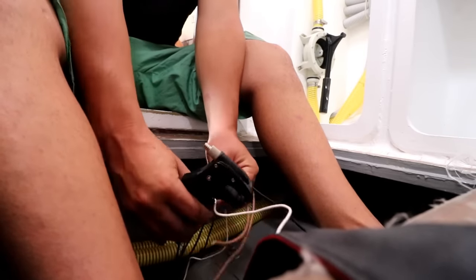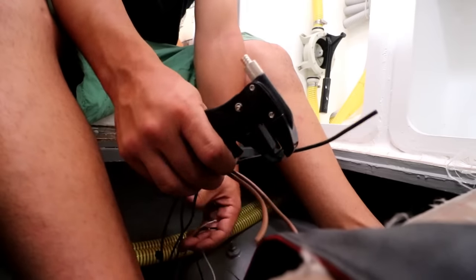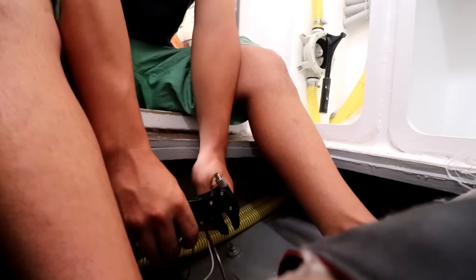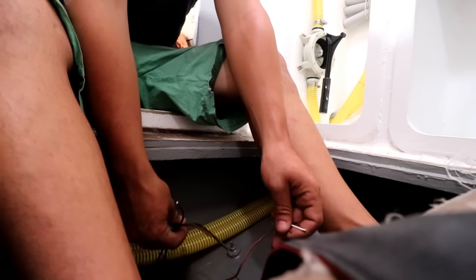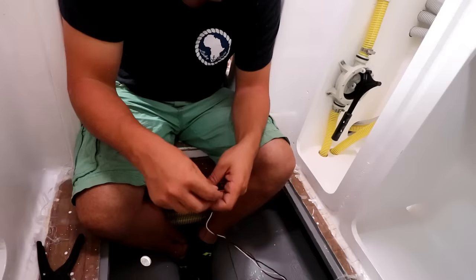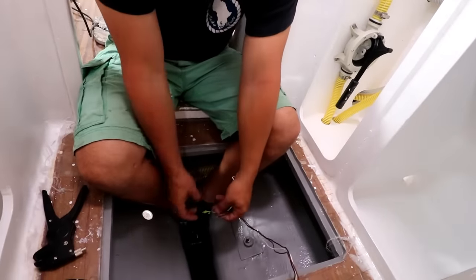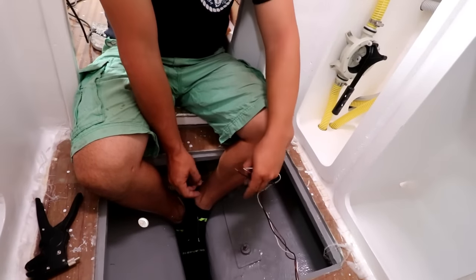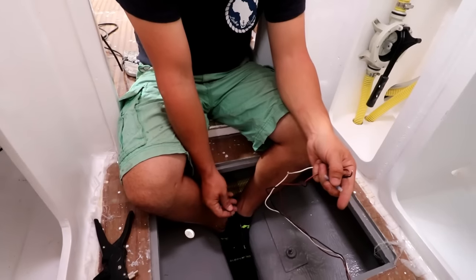Three wires and three wires — you can see there's more than enough. Connect them, start with the positive to our marked positive. As you can see this cable is 2.5mm and that's only a 1.5mm that comes with the pump, but I wired everything in 2.5mm. And the reason for that is for voltage drop and amperage carry over the length.